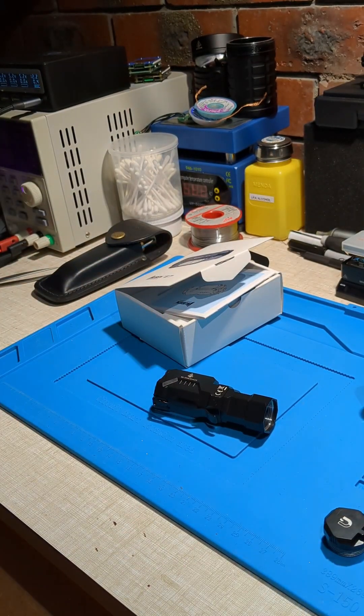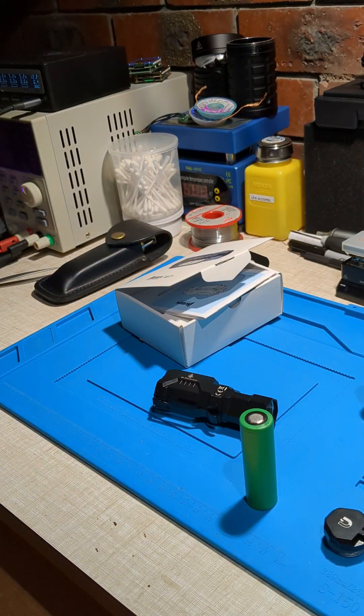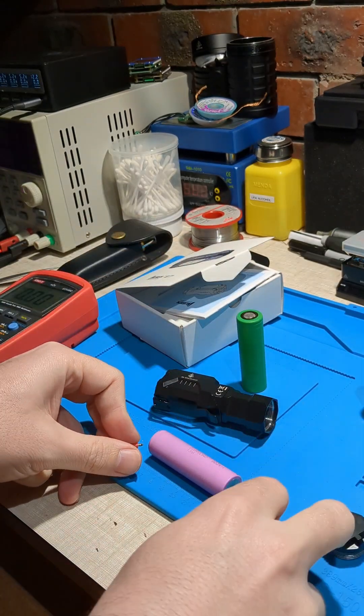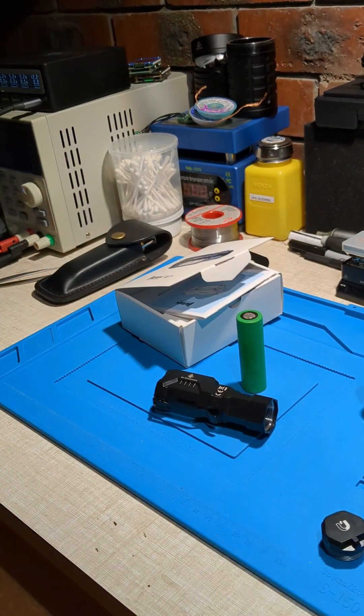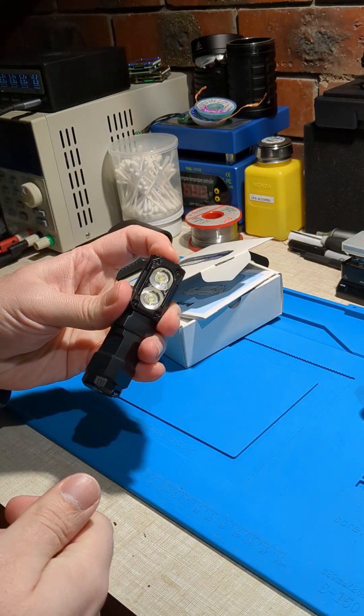Let's try another cell. Here's another cell — just double check the voltage. 3.6 volts. What's this one? 3.8 volts. 3.6 is a bit low — it's a storage voltage. Just doing this in one take, so you know there's no trickery — it's just normal.